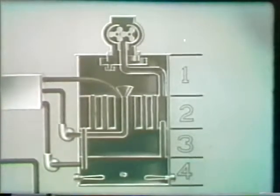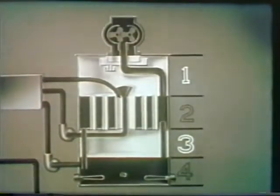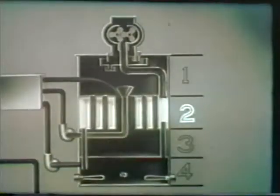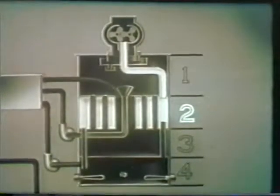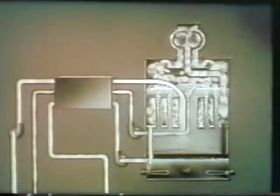Note the 4 chambers, that chambers 1 and 3 are connected by tubes, and that chamber 2 is connected to the compressor and to chamber 4. Only 4 tubes are shown here, but actually there are several hundred. This film shows in general how vapor compression distilling units work and how to operate them. For precise information about any particular type, consult the appropriate technical manual.